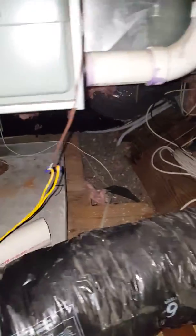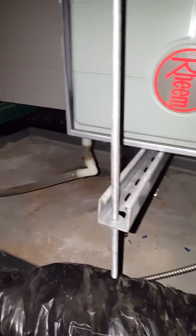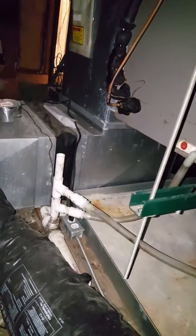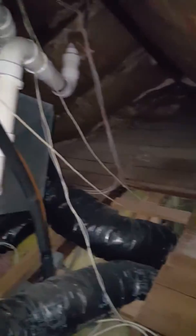As you can see, the current safety pan isn't even long enough for the current furnace. A new safety pan with a safety switch inside of it will get rid of this one. One PVC drain goes down that way — they've never had an issue with having the PVC-vented furnace in an attic. They've gone through and insulated everything really well up here, so I don't think we would have an issue.